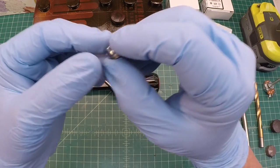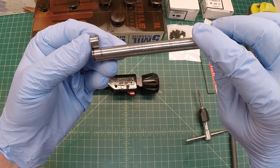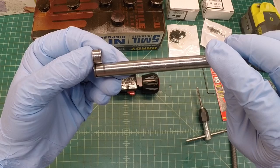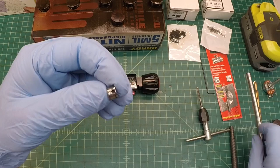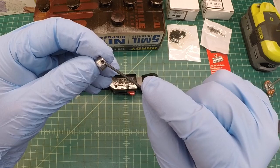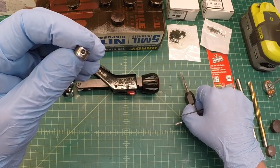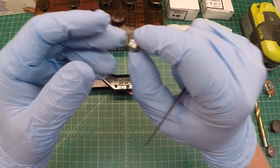I ended up cutting off a piece of the tubing, and this is the length that works best for the garage radio — pretty close to the same length I used on the Peter Pan radio as well. You can see there's the hole that I have drilled in. Once that hole was drilled with the number 36 drill bit, I just used the tap tool and went in there and threaded that out. Then this is inserted back down into the knob.